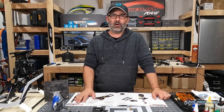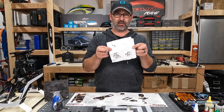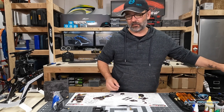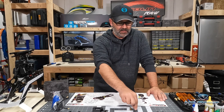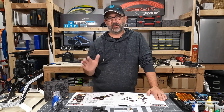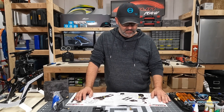I've gone ahead and cleaned all of the screws involved in this step. There's a lot of them — it'll take you a long time. This is just some of it, to show you just how gross they were. Tons of oil on the connectors. So do make sure you do a good job in that prep. Don't forget to clean the motor pinion set screws — that's super important. Your motor mount screws too, obviously you don't want any of these backing out. Do a really good job cleaning and getting those ready. And with that, let's dig into the motor mounting.